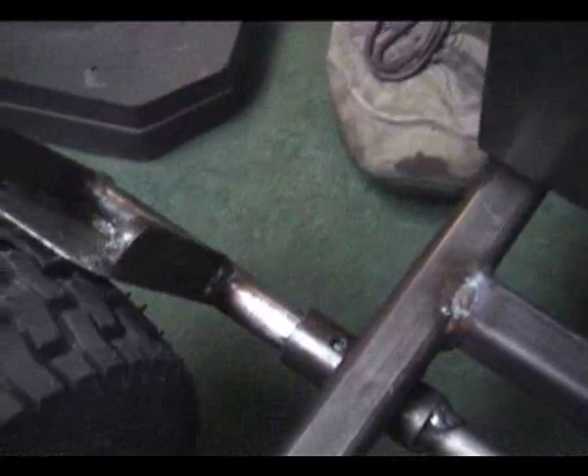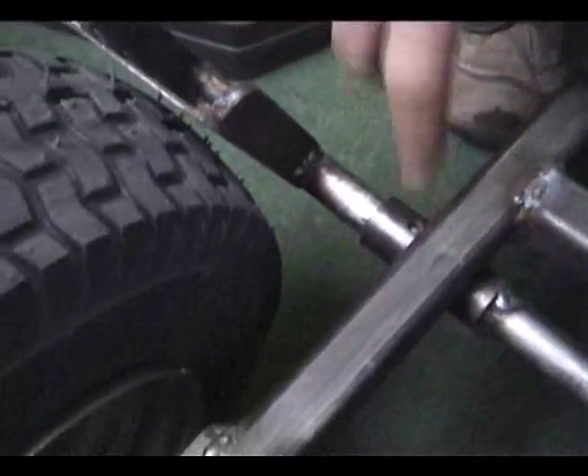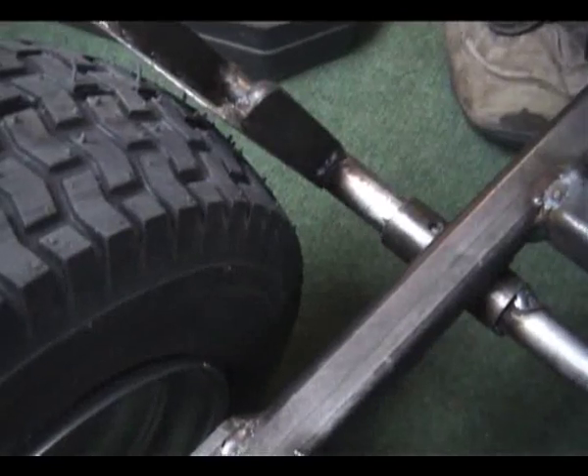Simply put some normal engine oil with an oil can onto there daily, and onto the other side as well daily — you can see the brake operating. Particularly if you're storing it over winter, a bit of oil all round won't go amiss. Coming further to the front, the steering has the same system — on the main steering joint there is an oil hole, and another oil hole at the bottom of the steering column. Oil those and you're doing great.